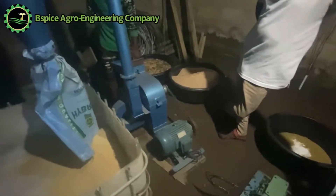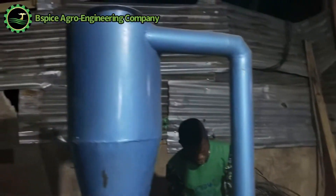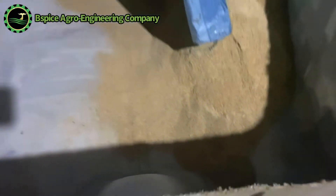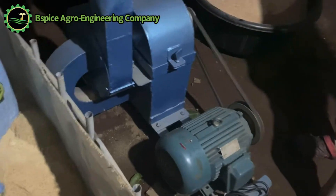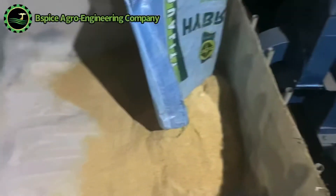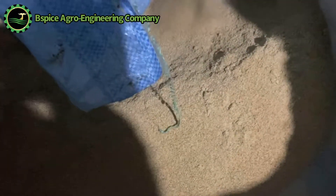The first line of action after getting your machines and raw materials is the pulverizer. The pulverizer helps you grind all these things into fine powdery form. Because if it is not well powdery, it increases the digestibility issues of such feeds, and you will not be able to produce 3mm, 2mm, or 1mm pellets — it will block the holes of your extruder machine, causing you to lose time loosening and recoupling the machine. So to have a good workable operation and produce a very floating, smooth, round fish feed, you need to have a pulverizer.